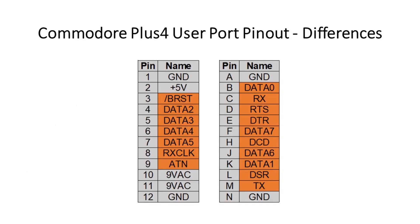The Commodore Plus-4 was originally planned to have a port of the game, but it's been shelved for the time being. However, if it ever is revived, the adapter is already designed to work correctly on it. You can see all the differences in the pinout from the Commodore 64, but fortunately this time the power pins are present and in the same location.